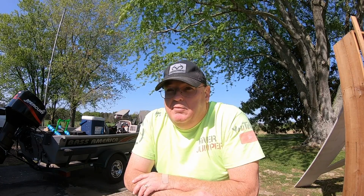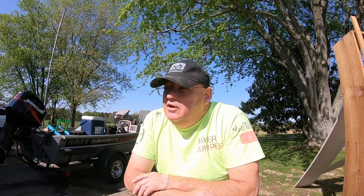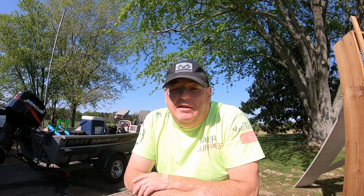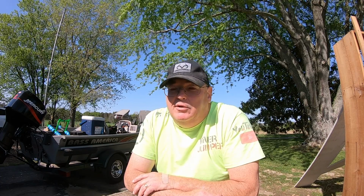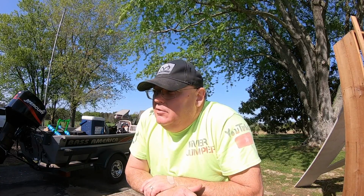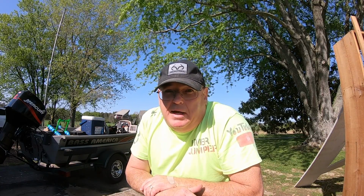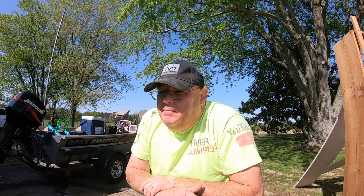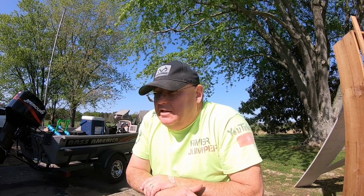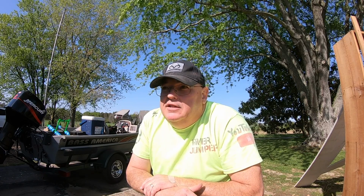And remember, if you can, that sticky stuff that I put on the bottom of that 2x4, you can get it at any big hardware store usually. That stuff keeps the moisture from coming from the concrete to the wood. I would recommend that, really good stuff. Also, make sure you Tapcon your base plate back down. And like I say, you never know what you get into when you get termite damage. It could be really huge, or like I say, I got lucky on this one, it wasn't much damage, so it was easy to fix.